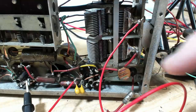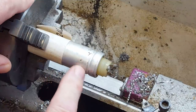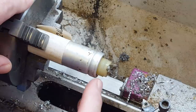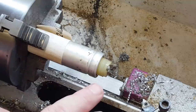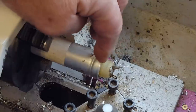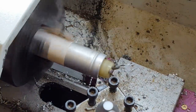Now I'm going back to my original plan: replacing the capacitors. I've got the electrolytic capacitor in the chuck here. Most people sensibly just peel it back with a screwdriver and crinkle it back again - you really can't notice it. But I do have the lathe, so I'm going to try and machine that end off neatly for a nice clean finish. Because it's only held at the end and it's aluminium, it's likely to grab and destroy the whole thing, so I'll go very slowly.